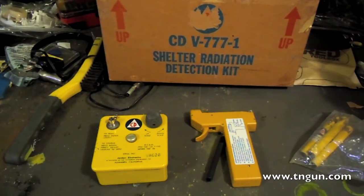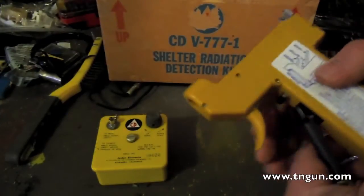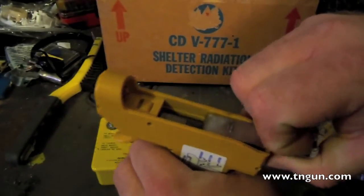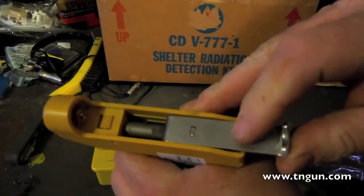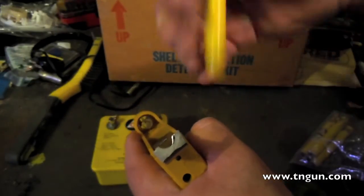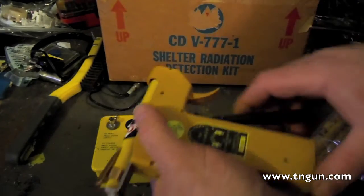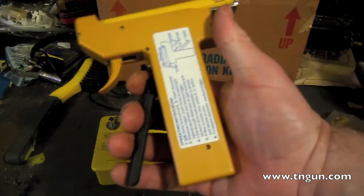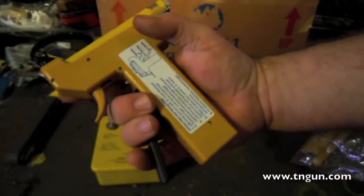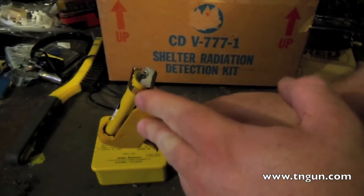The other kind of dosimeter — the one that I like better — is the hand charger. You've got a little lift-up clamp that you move back and forth because different manufacturers make them in different sizes. It's got a trigger that moves the clamp back and forth. You squeeze it, take the contact end, put it to the tip end, lay it in there, and let go — it should hold it pretty good and completes the circuit. Then, just like a little dynamo inside — like a little clicker — you squeeze it and it produces electricity. You hold this end up to your eye, pointing the other end up at the light, and you squeeze until you get the filament on zero.